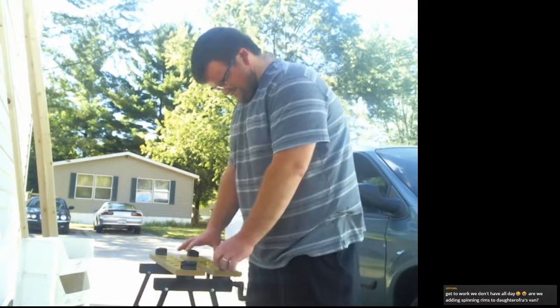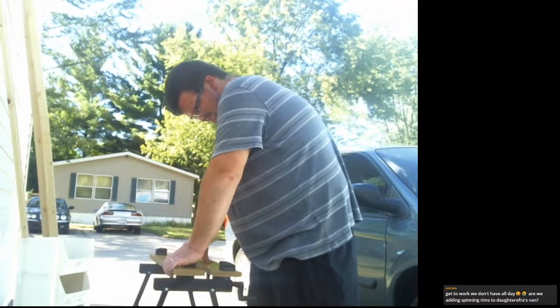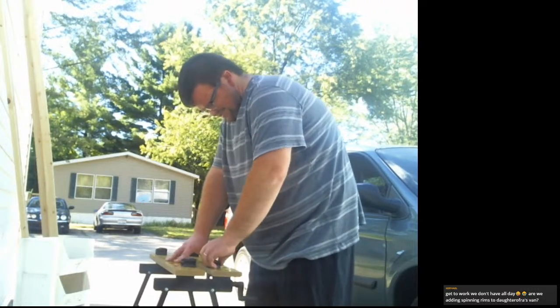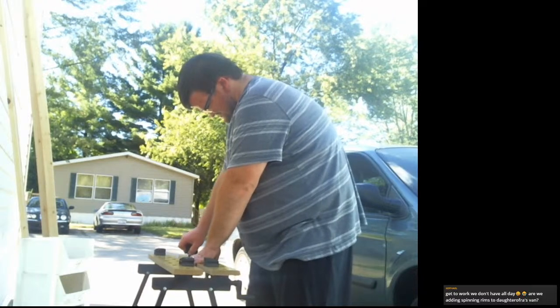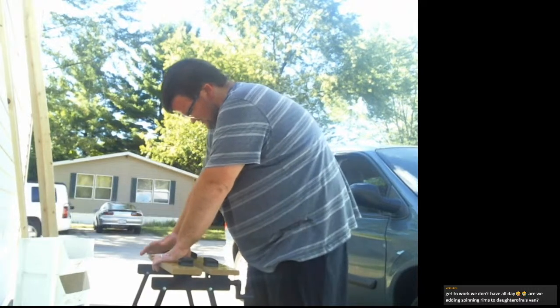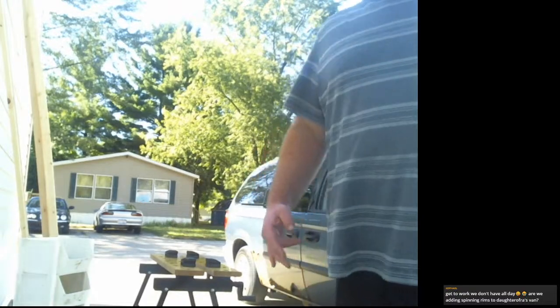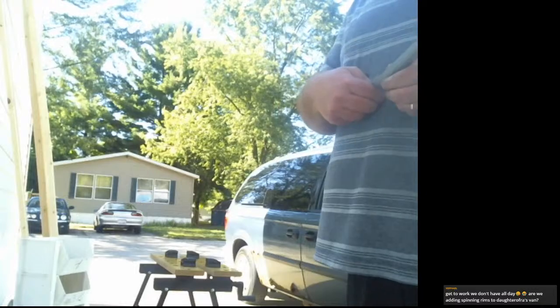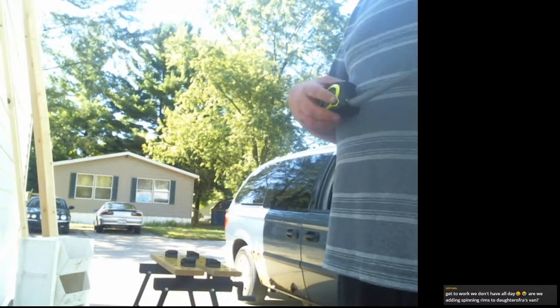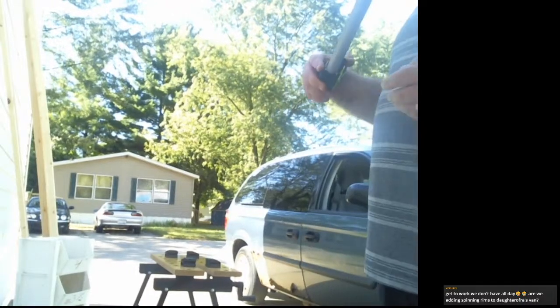So, what am I doing here? Well, our son is approaching a time of potty training, and we want one of them step stools, the kind you normally buy. Being me, I just want to make one. I have already measured the height of the toilet. That's 16 inches all the way up to the lid. I don't want to go quite that far up, so I was going to aim for a total height of about 14 inches.